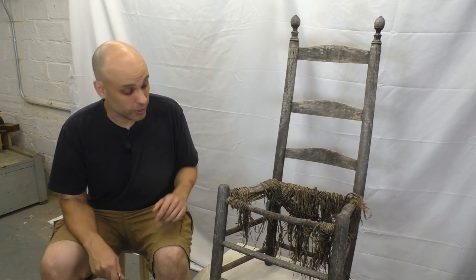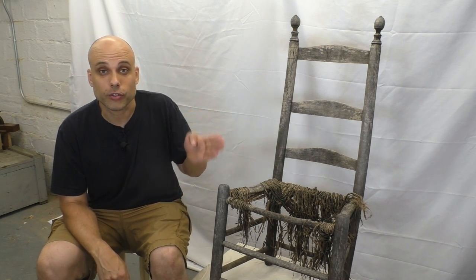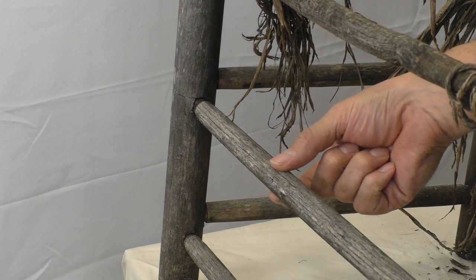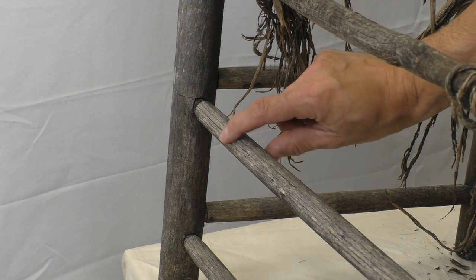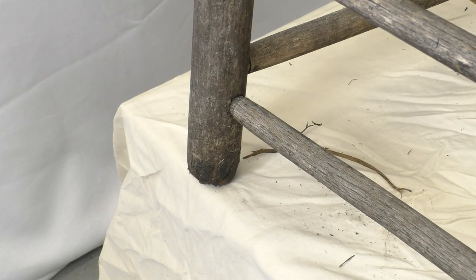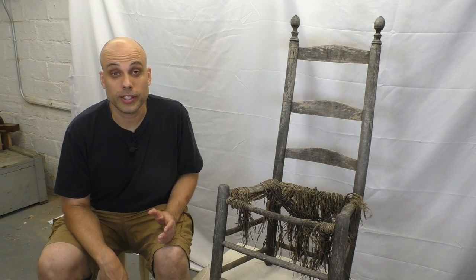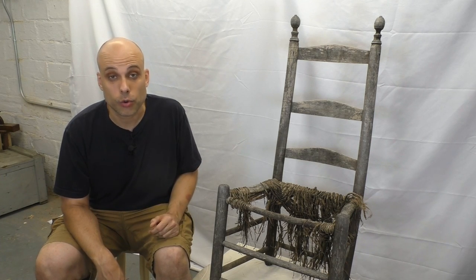The same measuring trick works on the seat rungs. With all of them, the plane of least shrinkage is oriented vertically. That means when the posts dry out, they clamp down on the vertical part of the tenon where there isn't much motion, and the joint is likely to lock together. The rungs are oriented so most motion is side to side, and the tenons are shaved down inside those mortises so they can't make the posts split. All of these are classic green wood techniques.